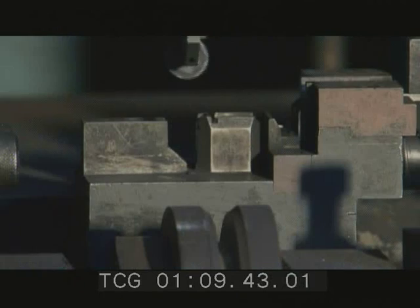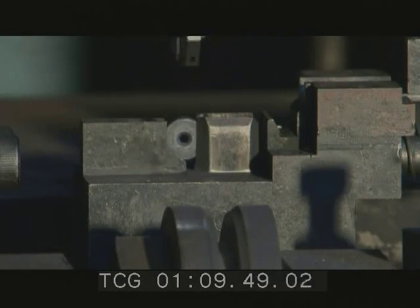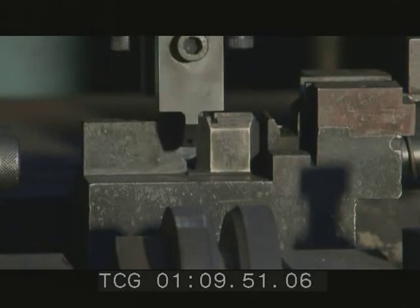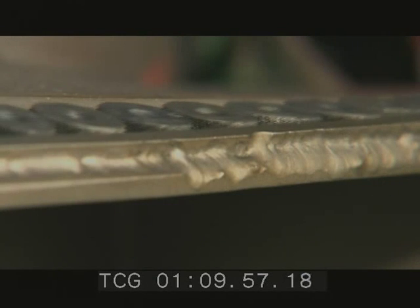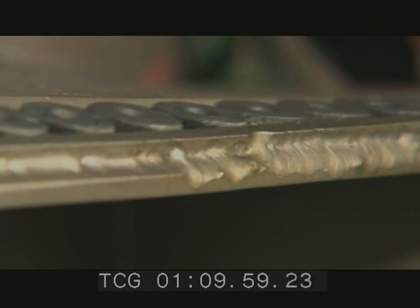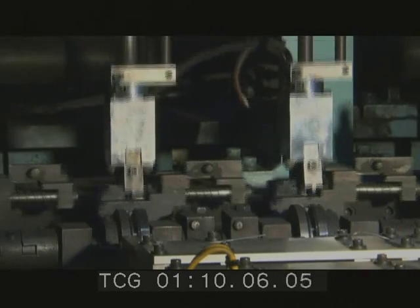Putting it all together starts with the tiny wheels that generate the friction that lights the flame. These wheels are made of super strong carbon steel, so they should last for 20 years or more. A robotic arm makes sure the teeth on the wheel are facing the right direction so they can gain traction on the flintstone to make the sparks.